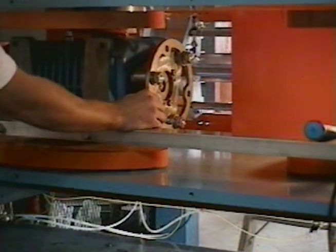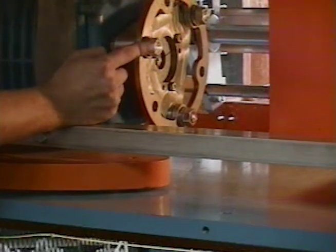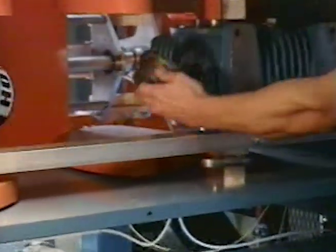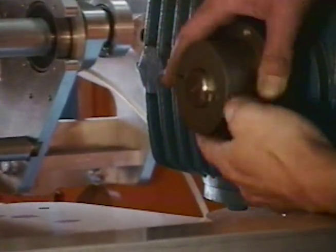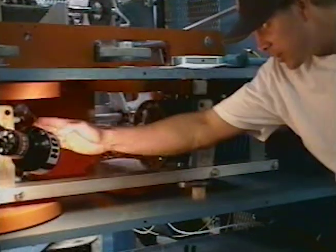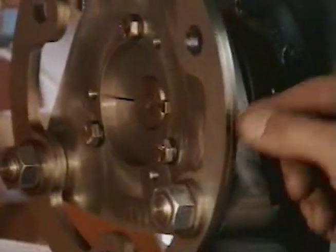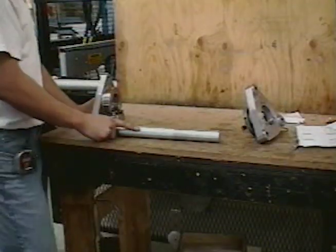So you have your bolts with the flat washer, then your flexible plates, and then a 3/16th inch diameter washer, and then your hex nut — which is just hand tight at this point. Now we're going to move over to the other gearbox. This shaft is a little longer than the other one. I'm going to take my QD bushing. Basically we're going to be doing the same thing we did on the other gearbox, except this will be in a different spot. I'm going to bring that flush with this shaft right here — that's where that will seat. I have my 5/8-11 bolt with my flat washer, my coupling flange with the flexible plates — four of them — with the 3/16th inch diameter washer and the 5/8-11 hex nut, hand tight at this point.